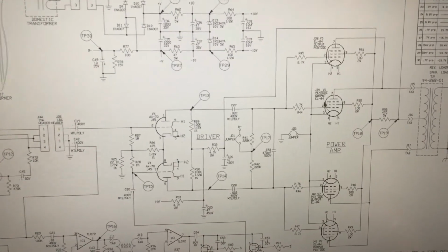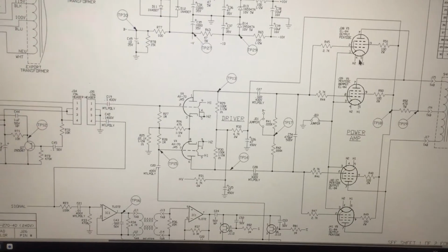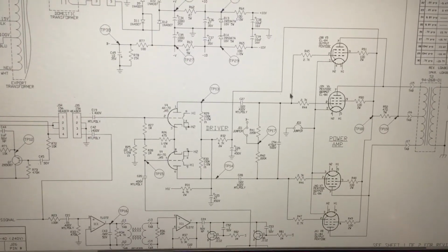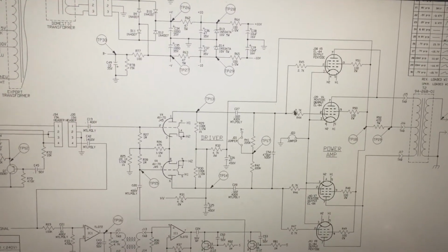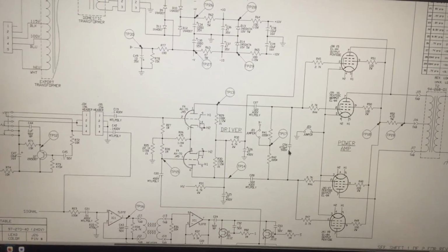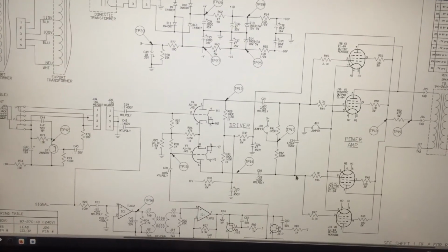Now, what we will do though is look at tracing some other lines. So here's pin 2. Let's follow that one. That goes down this way through that 2.7k resistor here. And you can see here pin 2 is also connected here. And if we go down, we've got this 500 volt cap sitting right here, 470 picofarad, 500 volt. That's giving us a bit of a sign.